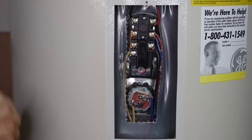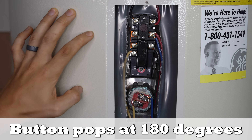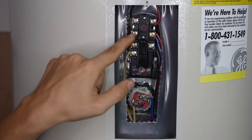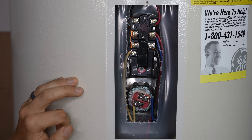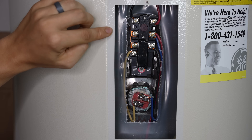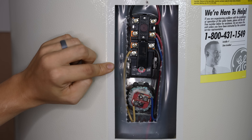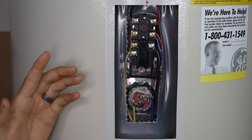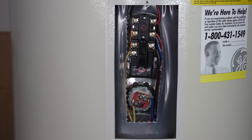Right on top, where you see that red button, that is our limit switch — it's there to turn off the water heater if the water inside is getting too hot. If the water goes over 180 degrees Fahrenheit, that switch will shut it off. There are times when it's just a false alarm and this thing trips for no apparent reason, and you can just press that button to reset it. But other times it does trip for a reason — one could be a shorted-out element, or the thermostat malfunctioning and not turning off, just keeps sending power to the element. Another possibility is a loose wire somewhere that could be triggering that little limit switch.